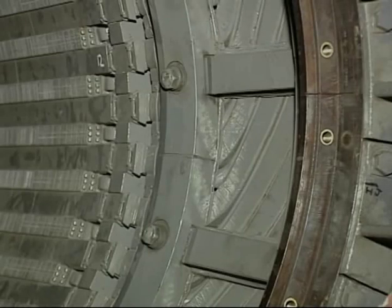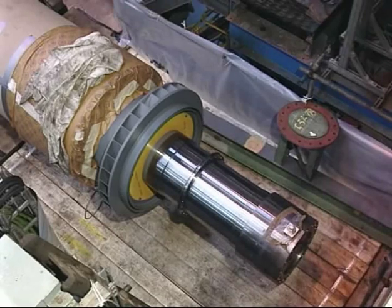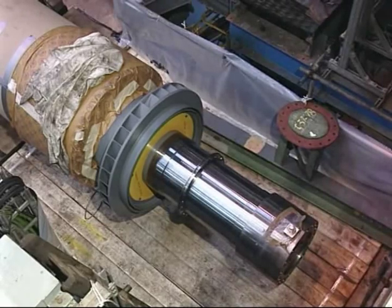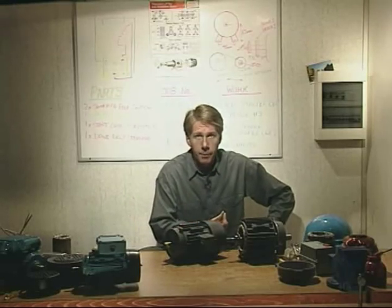The conductors which make up the windings in the stator of this alternator are connected into sets of three, each set arranged at 120 degrees to each other. When the rotor, which is in effect a giant magnet, is spun by the steam turbine, current is produced in each of the coils in turn, with the current changing direction in each coil once every revolution.